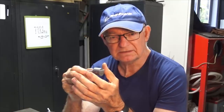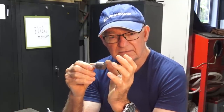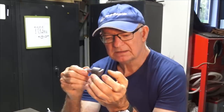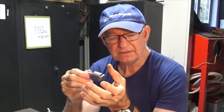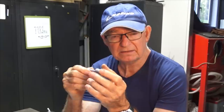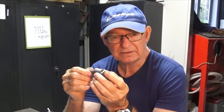We're going to heat it up until it's a dull red, hold it there, and then we're going to allow the residual temperature in the furnace to stop this from cooling quickly. Now, it's probably important that we don't put it directly into the flame in the furnace as well. So I'm going to pack it with some fire brick to shield it from the direct flame, and then we'll just keep an eye on it and allow it to cool down.